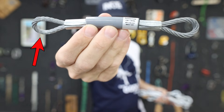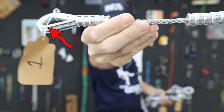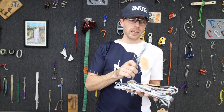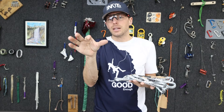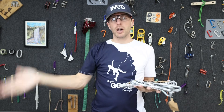That's not true — it's all in how you swage it. You'll notice this thing doesn't have any thimbles, whereas these do. Some of these don't have a thimble, others have a light duty thimble, and this one has a heavy duty thimble. The point of a thimble is to have a nice bend radius so the cable doesn't get pinched and made weaker. We want to maintain as much strength as possible.